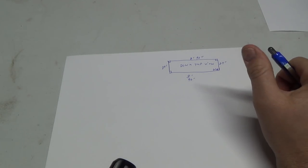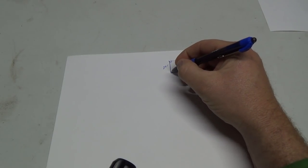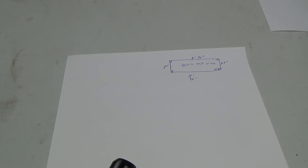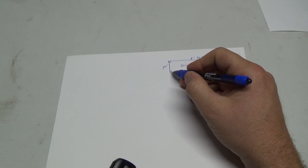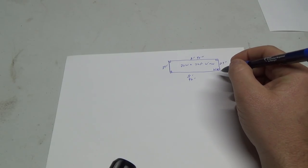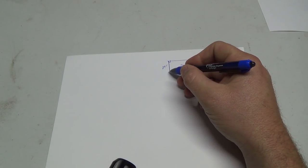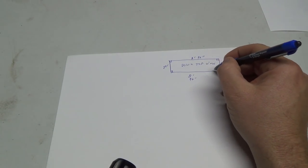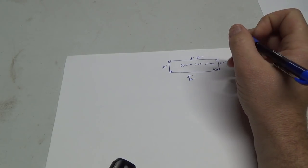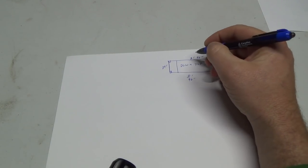really that much. Well, if I did two 2x4s, laminate them together and then glue them and screw them, I think that'd be a lot stronger, and that would give me plenty to attach the sides to. So we'll be screwing here, here, and here, and probably down through the top as well to hold the top on, and then all around the top. And then I'm thinking I'll probably do some supports this way, maybe one.